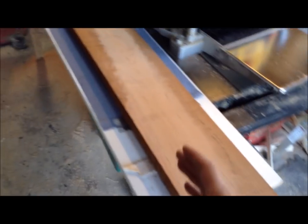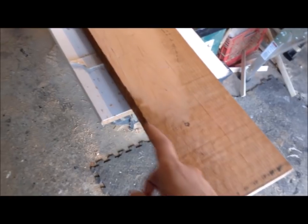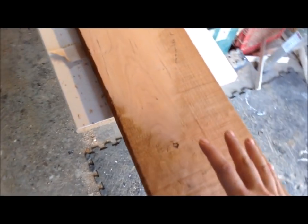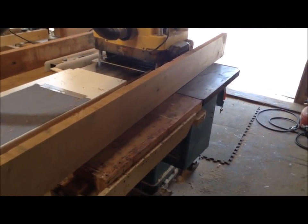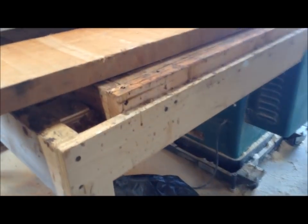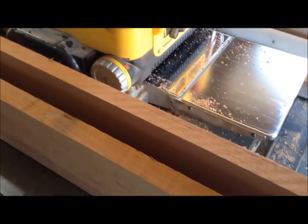This is the second one and it had a twist in it — you can see exactly how that twist went from one corner to the other corner, and how with it shimmed up on the front and top edge it's now trimming down where that twist is. I'm going to keep doing this one until the whole surface is planed. Let's test to see how flat it is. This is much easier to work with with that cleat in the front. If you put it on its belly you can see it's perfectly flat — those two pieces will now be surfaced on two sides.